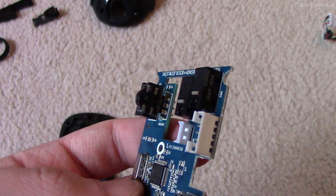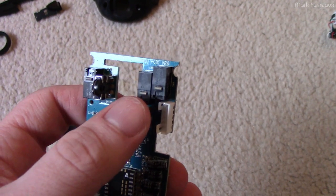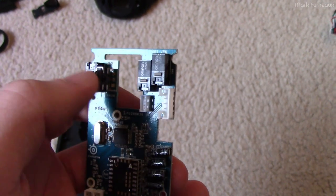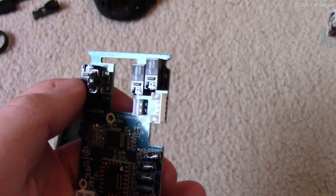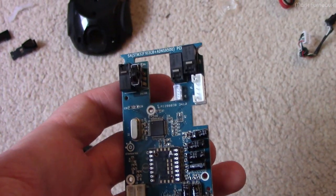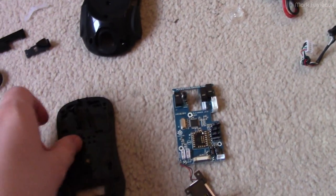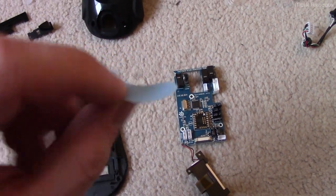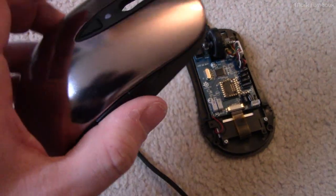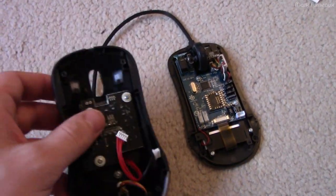Here it is after the replacement — I've just soldered on all three new switches. Super easy: desolder them, pop the new ones in. What's interesting is that on the silkscreen underneath where the TTC switch was, it actually had a 'T' drawn indicating the direction of the plungers, since two of them are upside down compared to the third. I really wonder if from the very beginning they were anticipating using those switches. I've got it all assembled, cleaned everything with Goo Gone, and the rest has been washed. Now I get to see if my homemade skates really work as well as I hope.